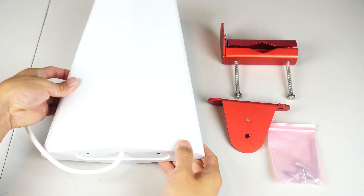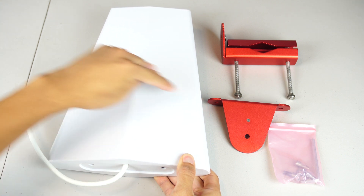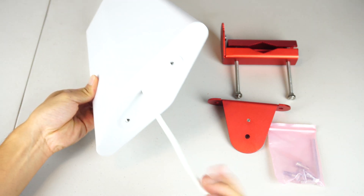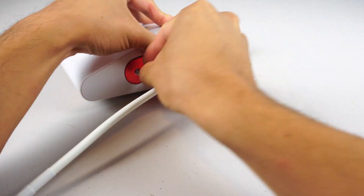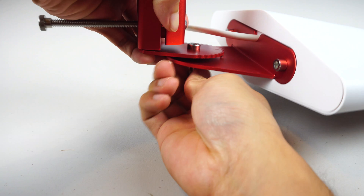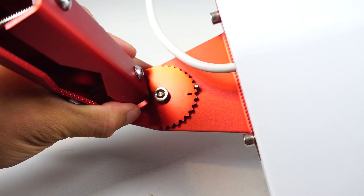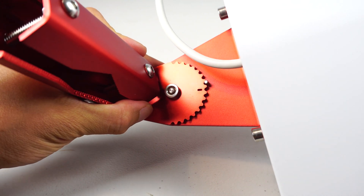This is the outside antenna. It measures 11 inches by 9 inches and 2.5 inches thick. It has a 9-inch coax cable on it. The metal mounting bracket attaches to the back with the included bag of hardware and then to the grip mount. The bracket is adjustable to help you point the antenna in the direction of a specific cell tower.